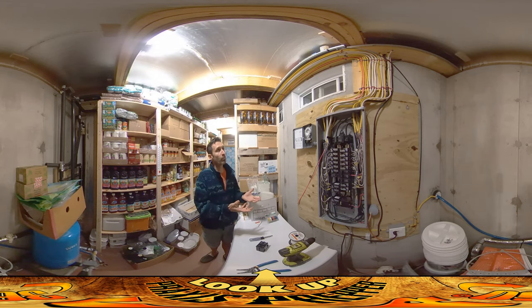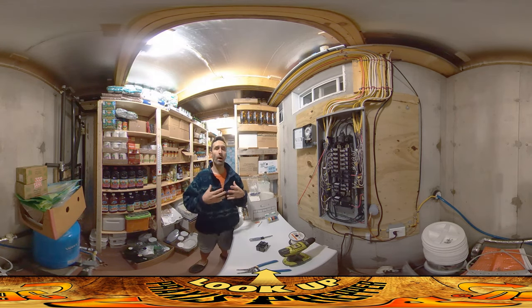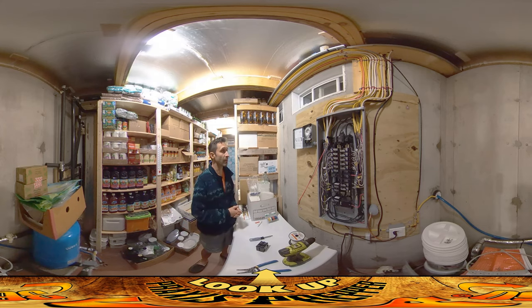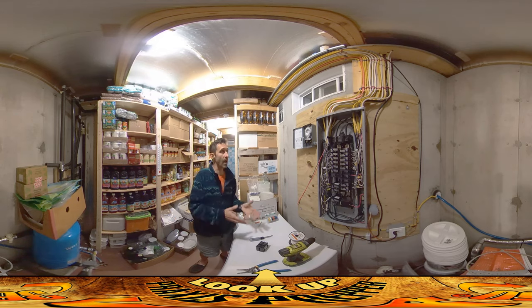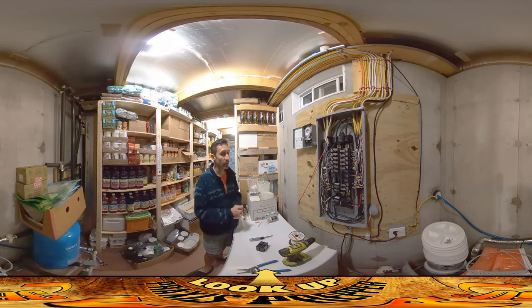So both for comfort and to keep the hot water valves from leaking, I'm gonna set up this timer so that just for an hour a day — at the end of the day, after sunset when there's no more chance of getting any solar energy for free — this will kick on. I'm gonna experiment with it; maybe it's a half an hour, maybe an hour, maybe more. It'll just keep the water temperature up around 110 degrees, because it starts leaking when it gets close to 100. We're gonna experiment and see how it goes, but I'm about to install it.